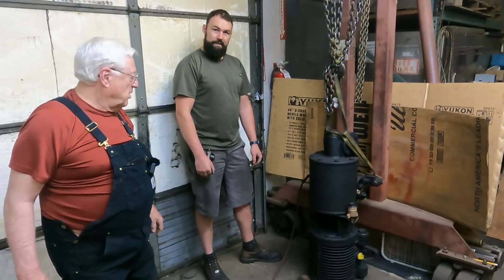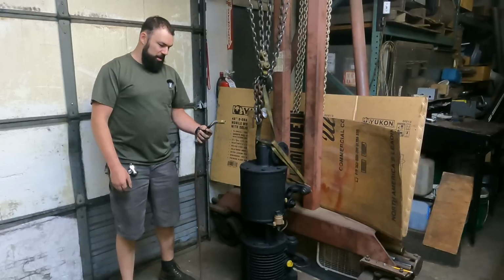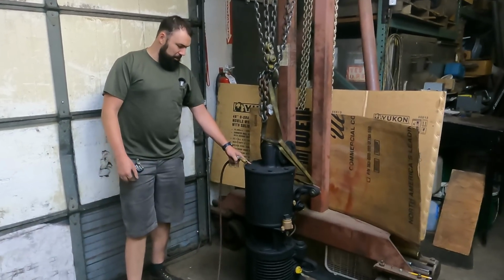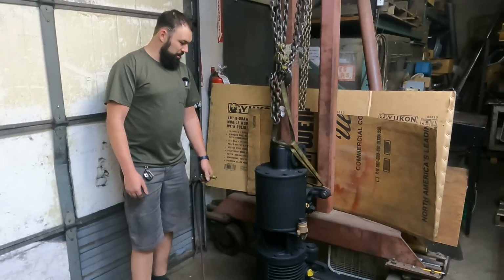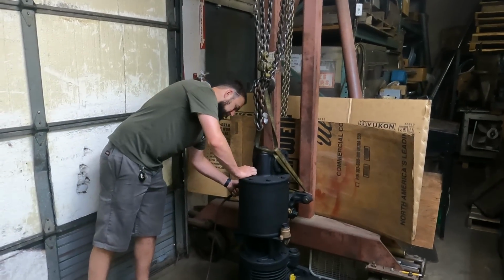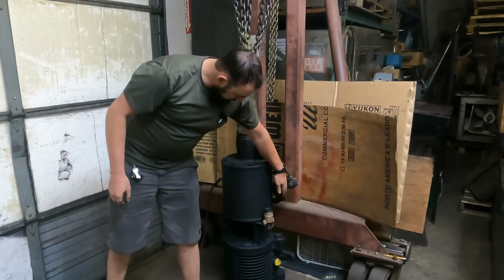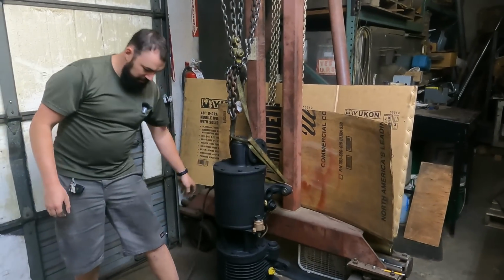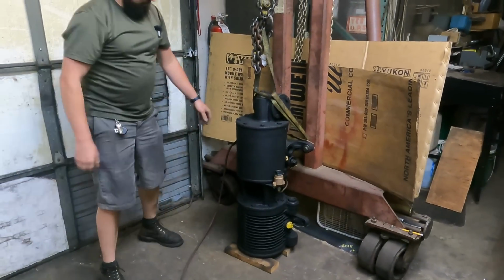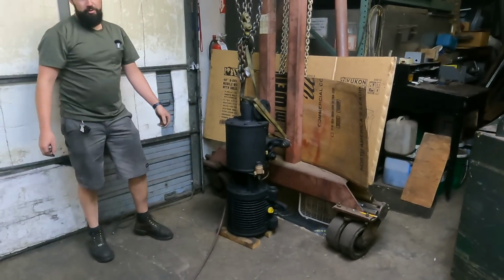This one you said you can operate it on air? Yeah. So after we get done rebuilding it, we can run it on a 1/4-inch line at 130 psi shop air. When it's strapped on the side of a locomotive, it'll be 1.25 inch, 200 psi steam. So if we can run it on a 1/4 inch, that's how we know we've done a good job, and going through and completely rebuilding it. Now everything coming out here would be steam, the airline, but everything down here is completely compressing air on its own, and in turn charging the brake system for the locomotive.